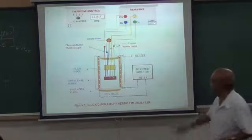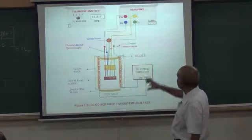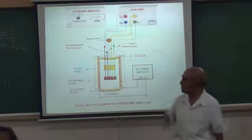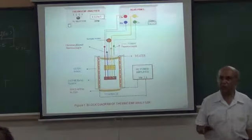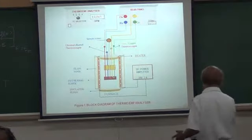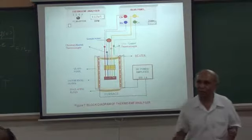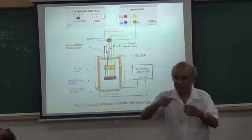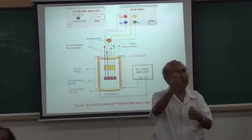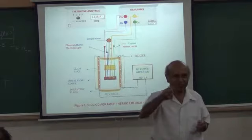But normally, the electronics is that, and the same instrumentation amplifier, after amplification, displays it digitally, like 1, 2, 3, 4, if I have 4 positions. The first position measures the chromel element. Same amplifier. It has what we call a band switch. It is a 2-pole 4-way band switch. You have seen DPDT, isn't it? Double pole, double throw switch. Center one, 2 things here, each one. Single pole, double throw, double pole, double throw. This is something more: double pole, 4 throws. 1, 2, 3.